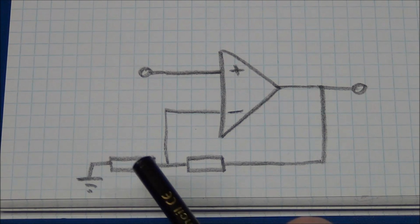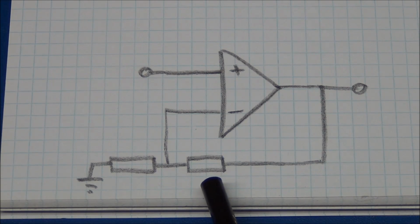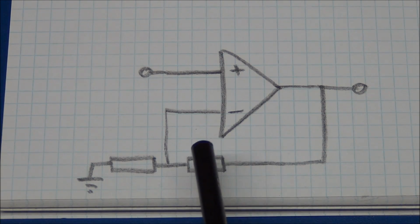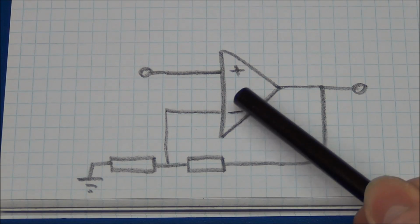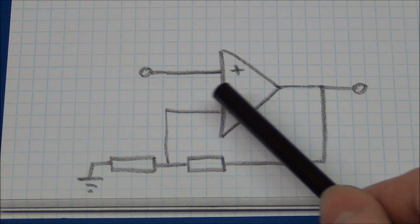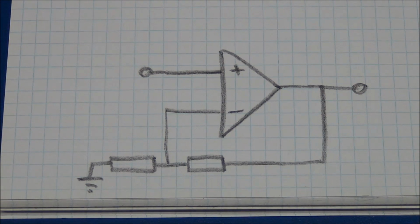So that will of course mean that if we put a resistor divider on one of the inputs, that will not affect the voltage in between here. As I said in my resistor tutorial video, if you try to draw current from this node, you will change the voltage. But we just learned that the op-amp will basically not take any current, so I don't think we will even be able to measure this with a fairly good multimeter. In fact, the multimeter will probably take more current than the op-amp when we try to measure it.